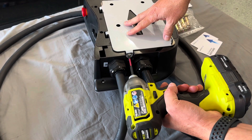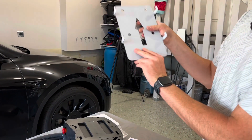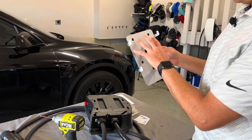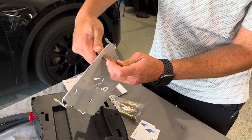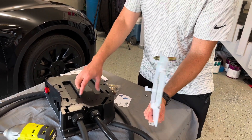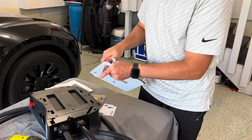To get the bracket off, there's just one screw on the back holding it. You can see how the bracket is notched — it looks like it just pushes down and comes out. We'll install that part on the wall and then be able to mount the unit on top. Mounting is really easy, but I want to put it into some studs on the wall because it is pretty heavy. If you use the included anchors, the back of the unit is slotted so the bolt can still fit through — it's really well engineered. I'm going into a wooden stud, so I'll just use some screws.